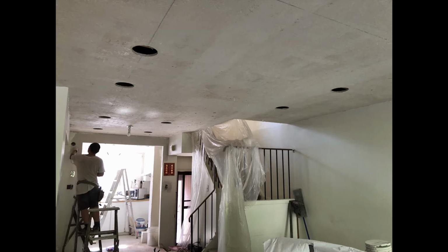Running the wires through the ceilings without taking the ceiling down is no joke. This task easily took the majority of days 4 and 5. If you have the option to run wires before putting the ceiling drywall, I highly recommend that you do so. Even if you are not sure you will need them, it's just better to have the wires in place. Running wires after is an absolute pain. You need to drill holes through your joists and fish the wire through little holes. At least the 6-inch holes provided more room to work with.